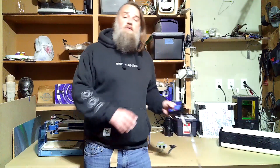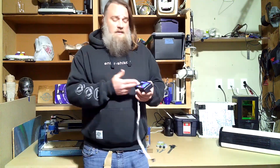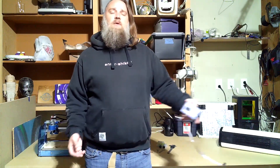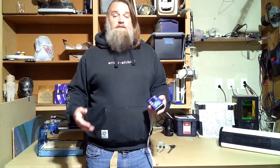Hi, welcome to another DE Hammer video. In today's video, we're going to be going over the Prover offline controller. I've seen people say this controller is a piece of junk, it's a waste of time, it just sits in the drawer and I never see it again. Well, when I was first setting up my 3018, I had it hooked up via USB to a laptop, calibrating it, figuring out my speeds and feeds. Once I got those dialed in, the offline controller became my best friend.